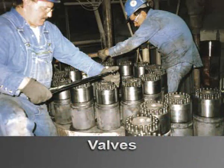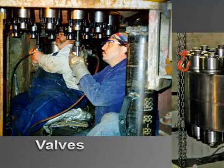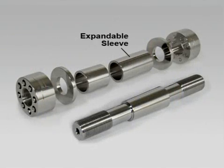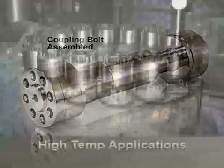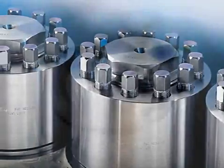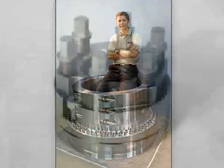SuperBolt tensioners have been installed on many types of valves and are ideal for awkward locations. For large couplings, a five-piece bolting system is available. Two tensioners force the stud into an expandable tapered sleeve — this system is easy to remove and provides the benefits of expensive hydraulic systems. For customers who have high temperature applications, we offer a complete line of high temperature tensioners using special alloys. And if you have non-standard bolting applications, we can design special sizes and configurations from a wide variety of materials to meet your requirements.